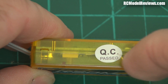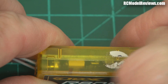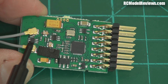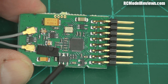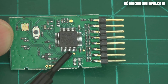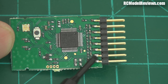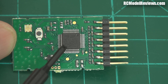Watch out, I'm about to violate the quality control sticker. As is the case with modern 2.4 GHz gear, not a lot to see here. We've got the little Texas Instruments chip here which does all the 2.4 GHz goodness. We've got our two antennas and a diversity switch which will select the antenna with the strongest signal. There's a little bit of power stuff going on here. There's your outputs, and if we turn it over, there is an ARM processor — 32 bits of goodness doing all the conversion and making sure that all the channel hopping works as supposed to.